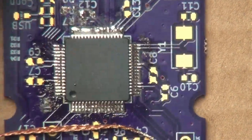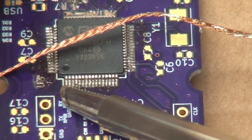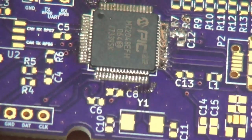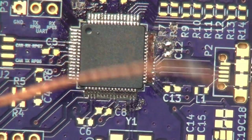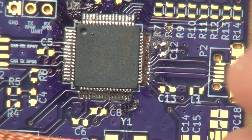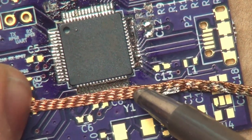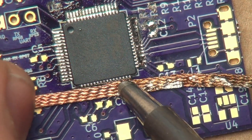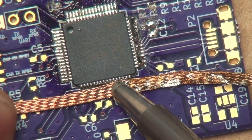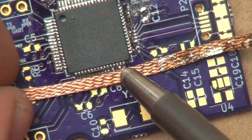There we go. We undid that solder bridge, and we can see that there's a distinct black mark in between each one of these, and then we can move on to the next one. I think this whole row over here is bridged together. Again, you take the solder braid and just suck it right out. The solder braid works amazing for this stuff, and not a lot of people realize this. You can actually see those little bridges get sucked away as soon as the thing hits the melting point, if you want to call it that.